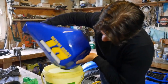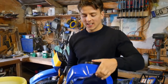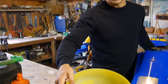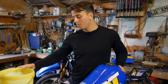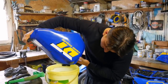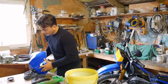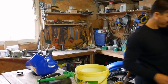That's what you're doing, Gary. So we poured acetone into this tank to try and get rid of all the crud that's on the inside of it. You can see, it's better. Yeah, it's a bit better than it was last time. Last time it came out completely black again. The petrol had gone off in there, hadn't it? And lined the tank out with a sort of varnish that settles out of the petrol somehow. And then it keeps bunging up the carburetor, the muck in the tank, so trying to get it clean, eh? Yep.